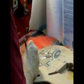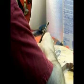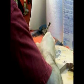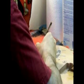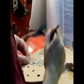And I'm going to do that as close as I possibly can in order to protect the inlay from any of the dye we're using. We're actually not using a stain, we're using a dye. And I'm really afraid that if I get the dye on something like the ivory, that it's just not going to come off without a lot of sanding, in which case I'm also removing the dye. So